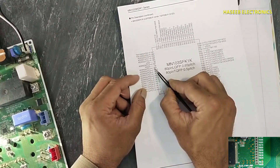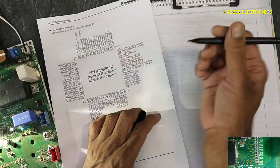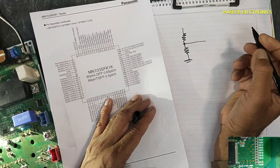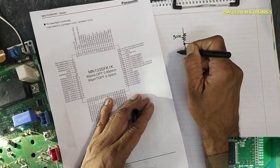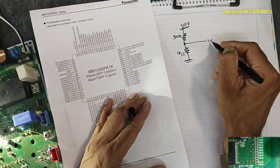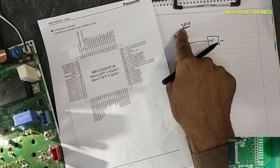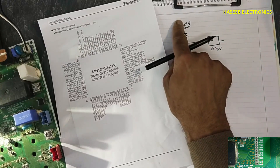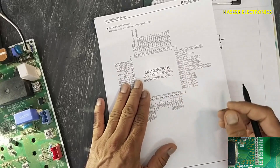Here is an analog input pin — pin number 9. That is an analog input; it will monitor the voltage. This pin is dedicated to monitoring the input voltage at the DC rail. Signals are always attenuated using a voltage divider network. For example, here it is using a 300k resistor and a 1k resistor. If there are 301 volts, 1 volt will reach the microcontroller and 300 volts will drop across the 300k resistor. When the microcontroller receives 1 volt, that means with this ratio, 301 volts are present. If it receives 0.5 volts, that means 150 volts are there.